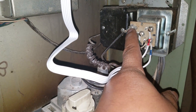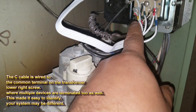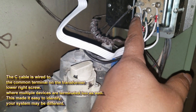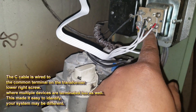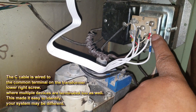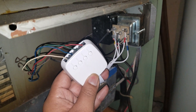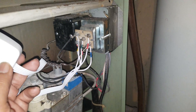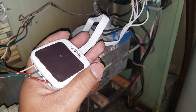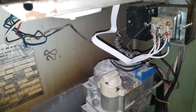All right guys, so this is the way it should look. We had our white, and now that goes up here in the W. We had our red, and it goes up here in the R. Our green goes right here in the middle. We've got our yellow coming up here into the Y, and the C goes into this one here. So this transformer is providing voltage here constantly, and that would be your C. And right here we have the Ecobee converter — four wires to five wires — and it's got a handy magnet. You can't beat that. You just pop it up there and now it's out of the way.